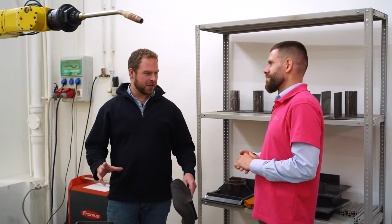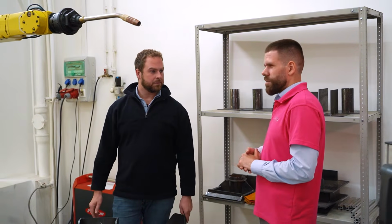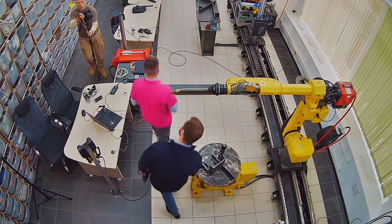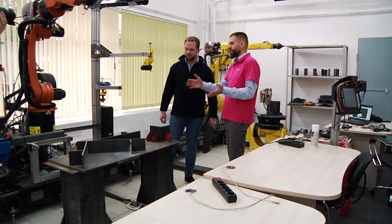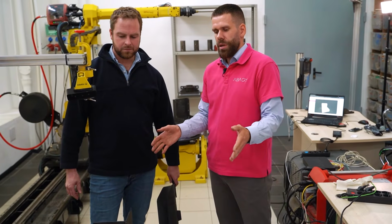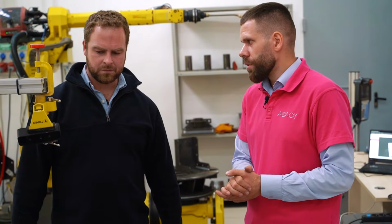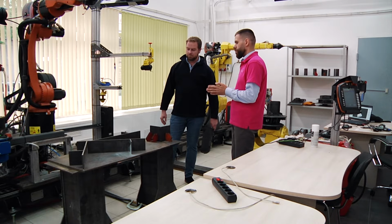So this sounds like a good set of challenges. The question is, why can't we just do it in the PA position to begin with? Good question. In order to describe it, I would like us to go to a different workpiece. Vertical, because when you have this heavy, long beam, it's not easy to turn it to a different position in order to achieve this PA position. So if the majority of the seams are horizontal, you may sacrifice some speed, but avoid changing the position of the long beam. That is why we need special welding parameters for the vertical seam to also be of good quality.